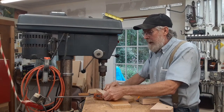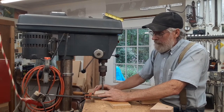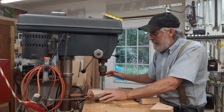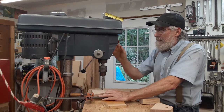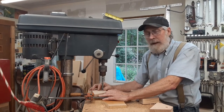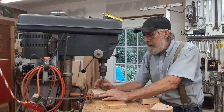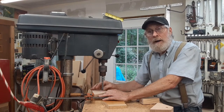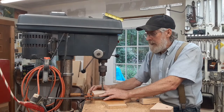I take a 12-inch clamp and put it on this piece of wood so that when I'm drilling, it takes up the torque so the piece can't spin. I'm going to drill with this drill bit, which is 33/64ths — it's one 64th bigger than a half inch. In this shaving horse, all the holes I drill for half-inch dowels or half-inch bolts I'll drill with this exact same bit. If you drill with a half-inch bit, all your holes are going to be tight — bolts and dowels both. That's why I use this bit.